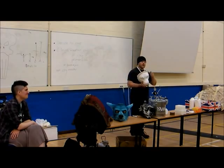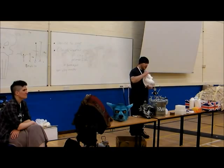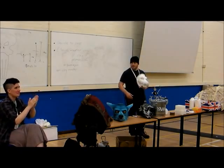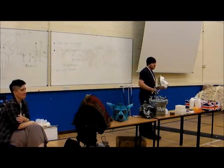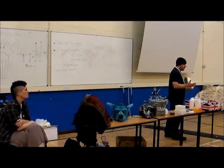Yeah. So you can do it, rather than with plaster, because plaster will die eventually, in fiberglass instead, and you get a nice solid mould. When you do it in fiberglass, you have to do the wall. You can't do the overlay. The nice thing with fiberglass is it's so strong, when you've got the two bits butting, you can drill holes and bolt it together with actual bolts. Very, very professional. When you do the fiberglass, you have to use release agents though. Vaseline won't work, because it'll just melt the Vaseline away.